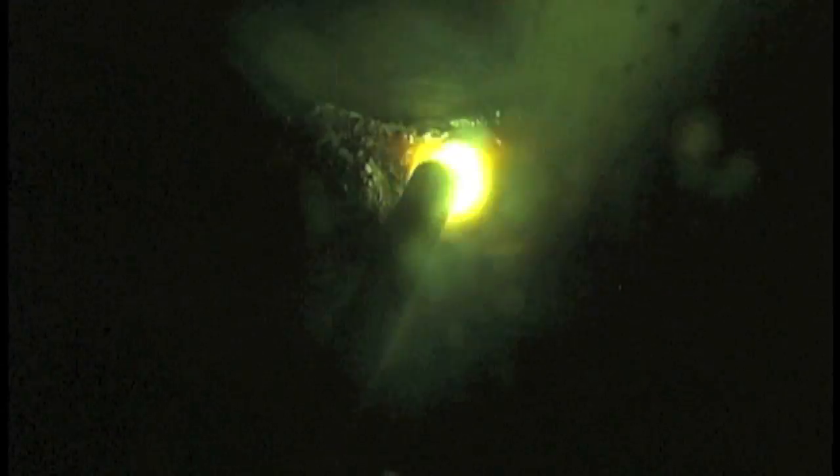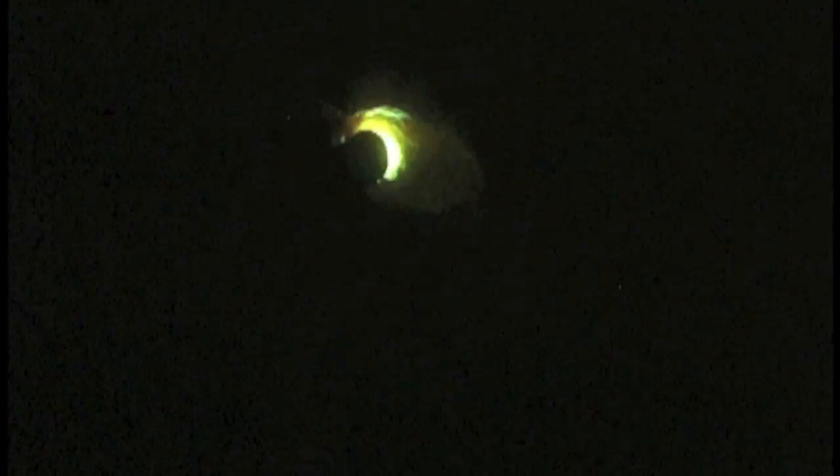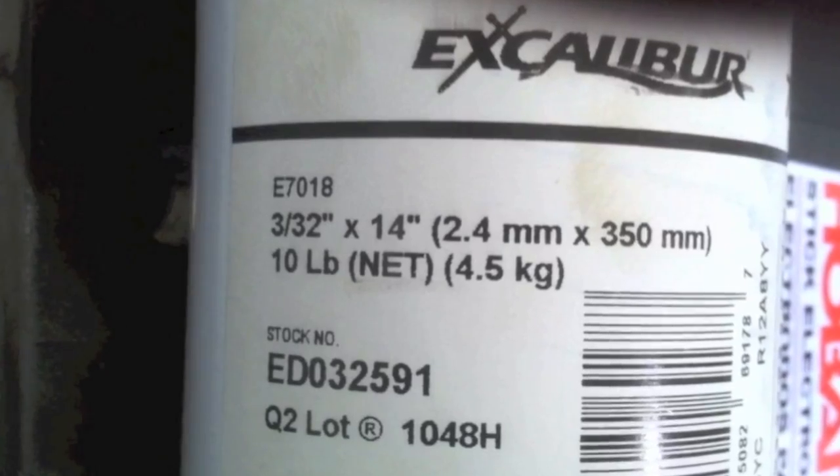That's one bead from the bottom to the top. I got a little bit of a lump on the bottom but it's probably not worth fooling with. Now it'll just take one more bead to finish this up. Same heat on the second bead — really watch the top to avoid undercut, and poke it in there to burn out any slag that might be left. Mainly you've got to watch the top, maintain an even travel speed, no low places, and no undercut.